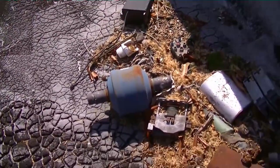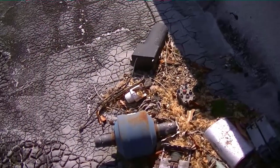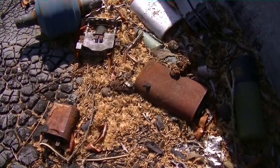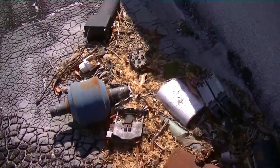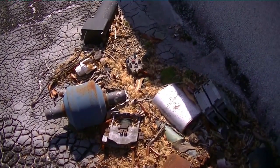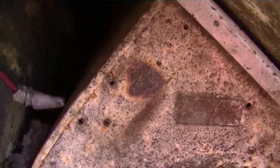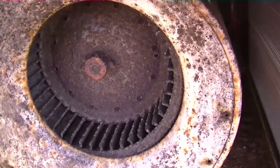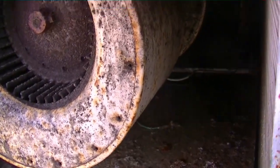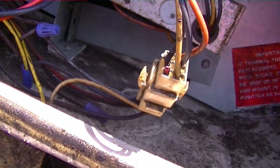You can see the history of this unit — suction line dryer, run capacitor, a breaker, super boost, a couple of run capacitors. It is hilarious, kind of funny. These are not large items — could toss these aside pretty easy. There's even a relay over there. We got a dual shaft blower motor, two blower wheels, both of them look extremely disgusting, off-centered, horrible. Can't fix everything in one day, but I can get it going and let them know what needs to happen — which is basically a wrecking ball.